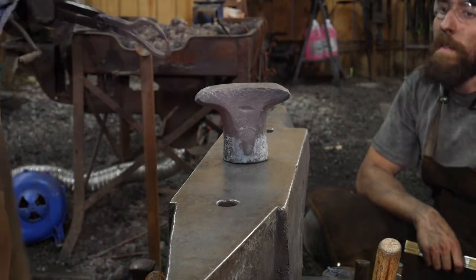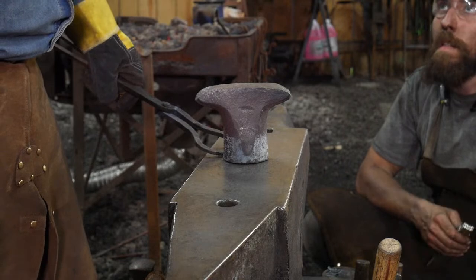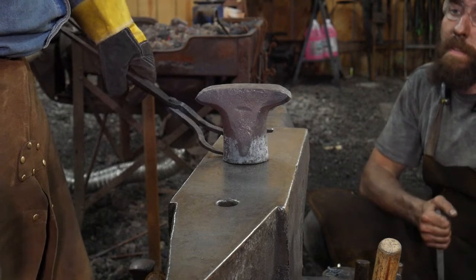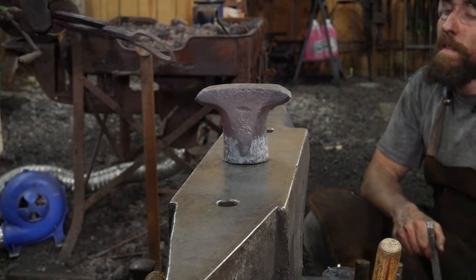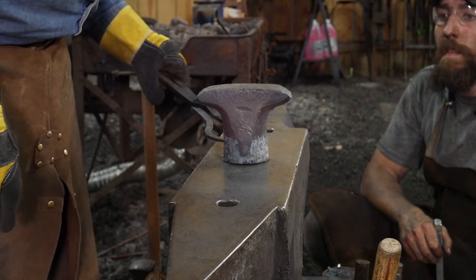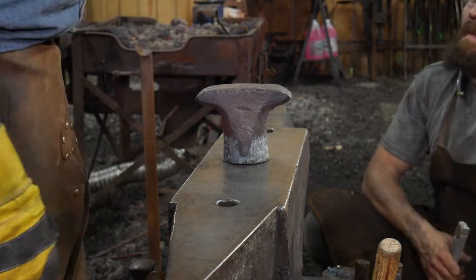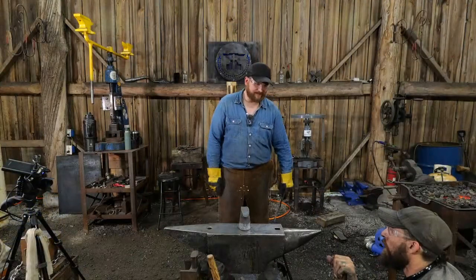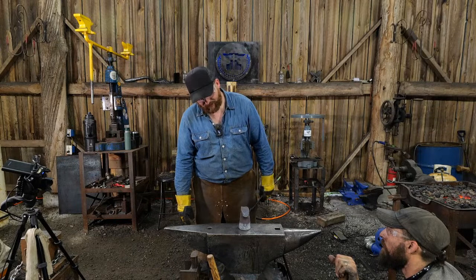And the benefit, ladies and gentlemen, is this could be dropped into a bit of fence post pipe with a plug welded in it, backfilled with sand or gravel. It would be like a little post anvil that can go right by the forge. That's the way I would use it: sitting down an inch or so into the end of the pipe, as a post anvil for setting small welds on things. That's what I would do with it if I was going to use it and not just put it on a shelf. But it'll be a great, interesting conversation piece nonetheless.